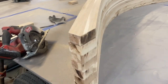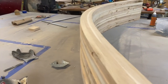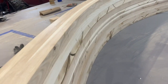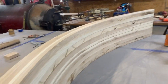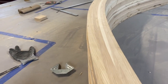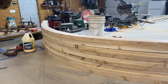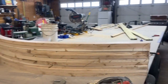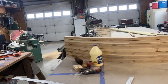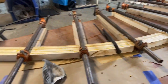Okay, guys, so I got some rafters all cut here. I got 9 of them made. They're pretty good. There's a little bit of variance in the size, but not much. If you ever do this, run these strips through the planer and you'll have a little more accuracy. It's good enough for framing the roof, but there is a little tiny bit of difference in each one in the thickness of it. But it'll work fine. They're on every 32 inches and there's gonna be a purlin on them anyways, but there's 9 of them and I got one in the jig here.